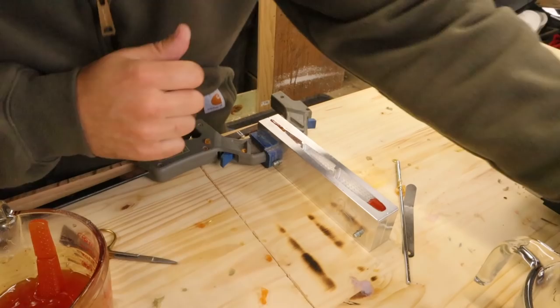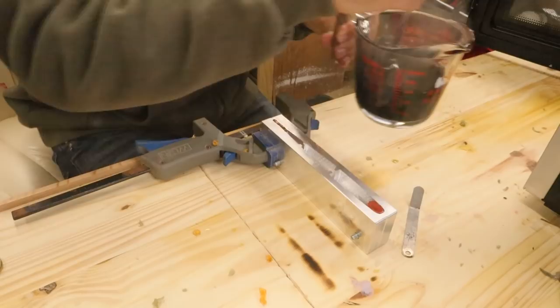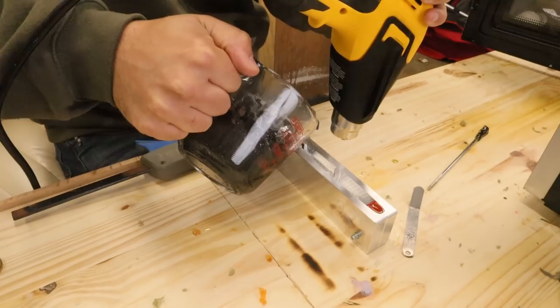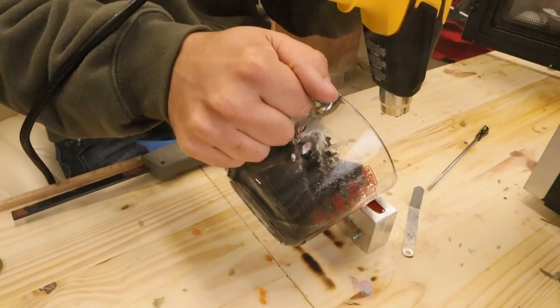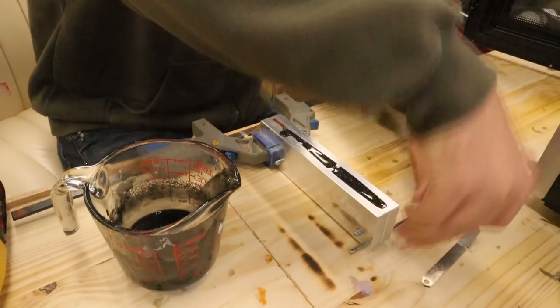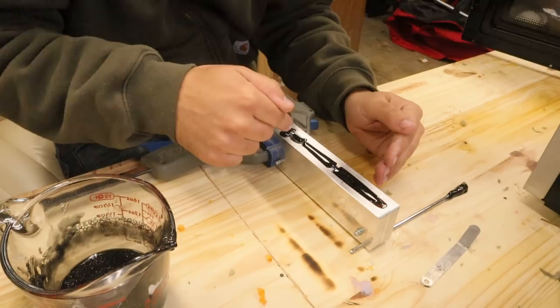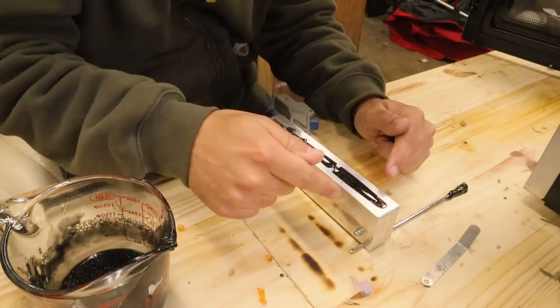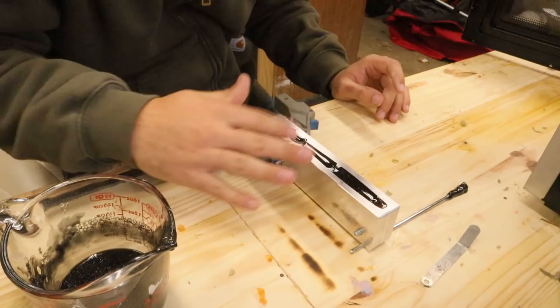For the entire rest of the body of this bait, I'm thinking I just want it to be black. Never mind — sparkly black. I hope you saw my technique there because I'm going to have a hard time explaining it. I was having the plastic right there and ready. I poured it over here but it slowly came up over there, then I put the heat gun on the plastic up at the head and just started pouring hard over here until it started hitting that heated plastic, then I took the heat gun off and it instantly got up there. It's kind of overkill because I'm going to hit this with the propane torch and it's all going to melt into itself.